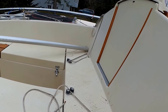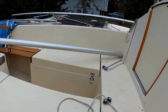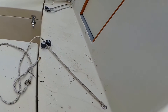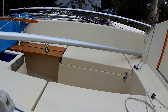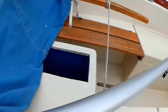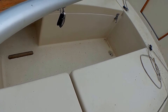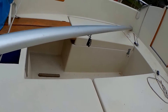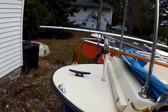Quick look in the cockpit here. It's a fairly spacious cockpit — according to the literature it seats six, and I don't have any trouble believing that. These lines here on either side are the controls for the bilge board, so she's twin bilge board — that's what she has for appendages. There's the motor well there. The cockpit is not self-draining but does have a drain plug for when it's sitting in the driveway. Two large storage lockers, and a tiller with brass hardware.